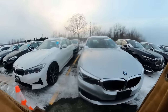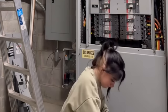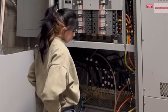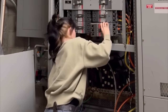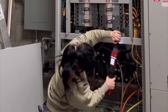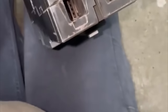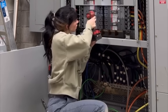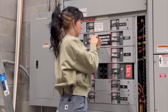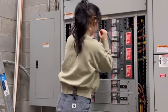I had to leave for Vegas that day so I didn't finish, but we are going to do the breaker replacement — we got it. We ordered two breakers because the bottom right one I'm changing was also blown up bad, and I had a feeling if I turned it off it wasn't going back on. The customer wanted everything new. This is why preventative maintenance is so important — all these lugs were loose, and it's really important to torque to spec and perform preventative maintenance regularly. The boys grounded out that energized manhole and drove a ground rod down while I was gone — that stopped that issue. Stay tuned for part two.